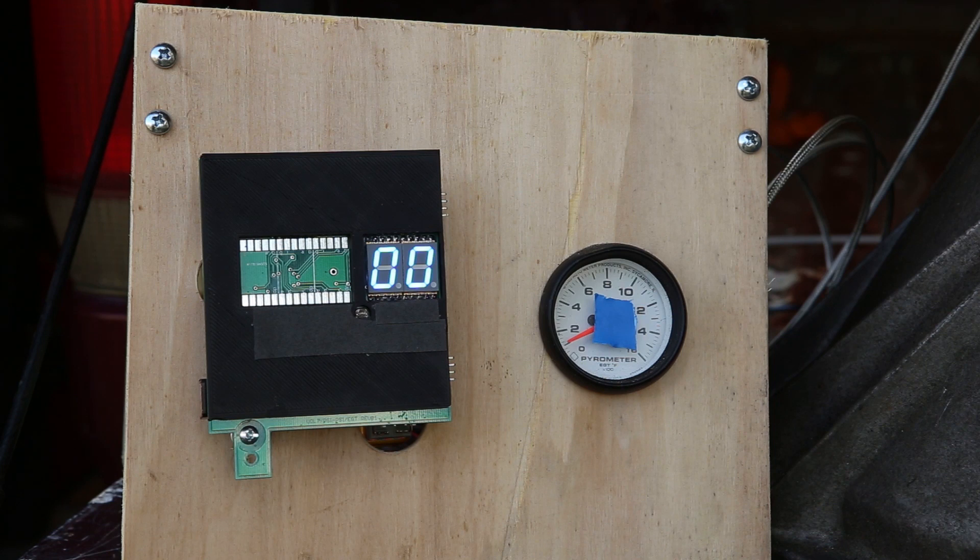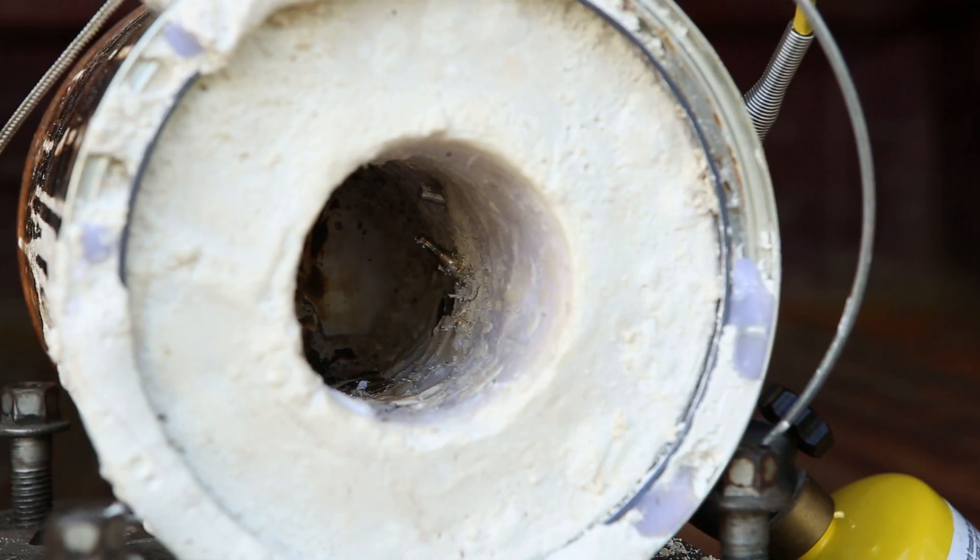Gauges are powered up. My gauge reads zero; brand X's gauge is sitting right at about 100 degrees. I want to mention the current air temperature is 87 degrees Fahrenheit as I look at my shop thermometer. The two digits on my gauge — you're going to multiply the display reading by 100, just like on brand X's gauge. So if we get a one displayed on my gauge, that's actually 100 degrees. Here's a close-up of the inside of the furnace — you can see the two thermocouples and just make out the burner tip from the torch in the back.